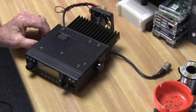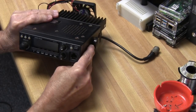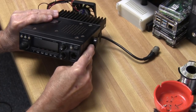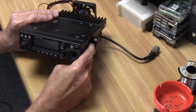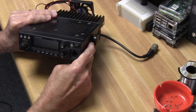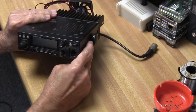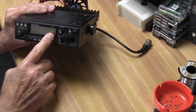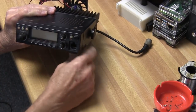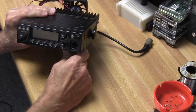This Radio Shack has a similar Squelch circuit in it. However, we're going to be connecting it to a PC on a serial port, which is not TTL logic level, and the two didn't agree with each other so much, so I had to build a little buffer circuit to put in here. We've used this rig for years for a local Echolink node, and it has worked great the whole time. It's pretty much just a stock Radio Shack